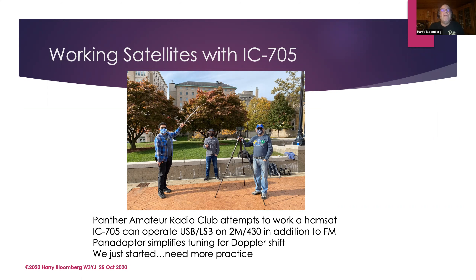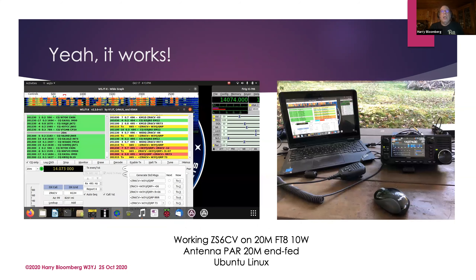For satellites — here's a picture of some members of Panther Amateur Radio Club a couple weekends ago in Pittsburgh. Note that I have the 705 up on a camera tripod at eye level. We're trying to work satellites: the 705 does 440, and with the pan adapter you can see the signal coming into your band pass and track it. We're going to try this again using the 705 to receive and an FT817 to transmit for full duplex. With the clip-on battery on the back you only get 5 watts, but it's worth it for the convenience.